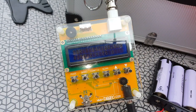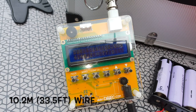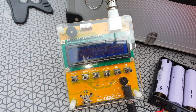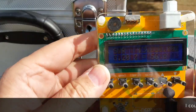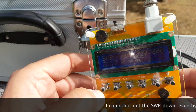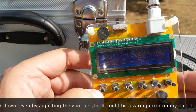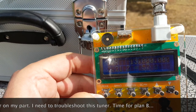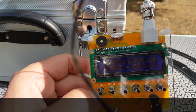The lowest I could get is 4.35 to 4.4 to 1. So I guess my wire must be too long — I need to cut a few inches off. The least I can get is 3.2 to 1 at 13 MHz, so that's more than 1 MHz off, and I already cut a couple of feet off, so I'm just going to have to cut more.